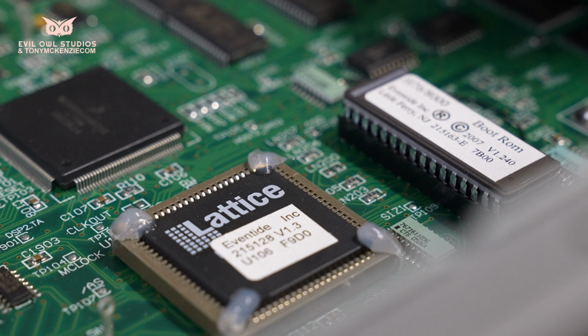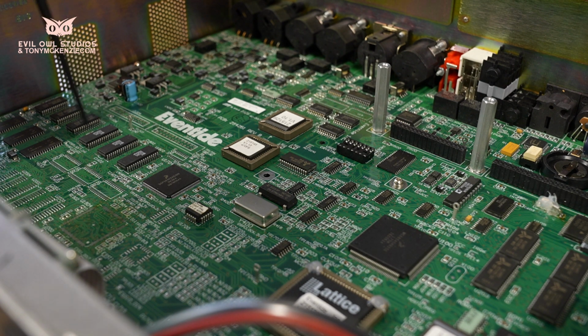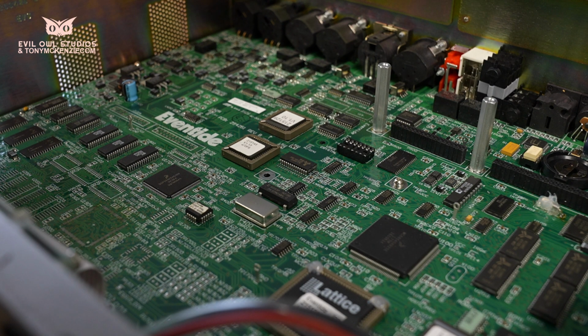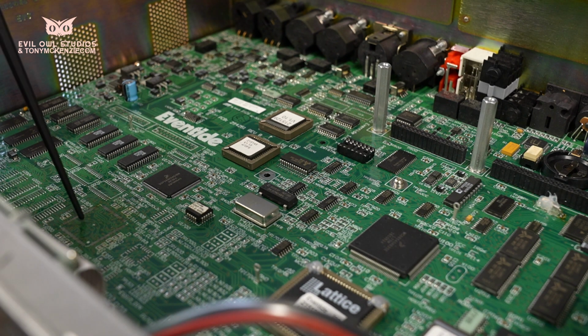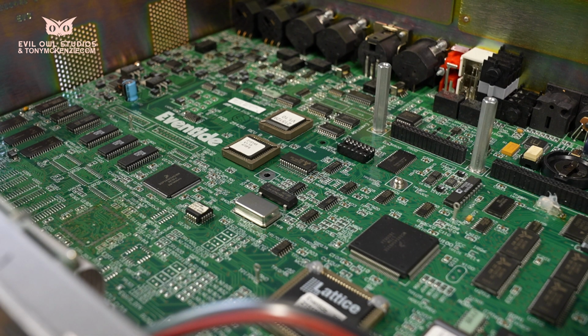It's always been a good bit of gear. Now, looking at the device from over this side of the board, you can see there's lots of memory. But if you look just a bit more this way down here, you can see there's lots of holes as well, and there's another processor missing from there. Look. Yeah, that's a DSP. This other one clearly is for a second DSP and its associated memory and the rest for the H8000.